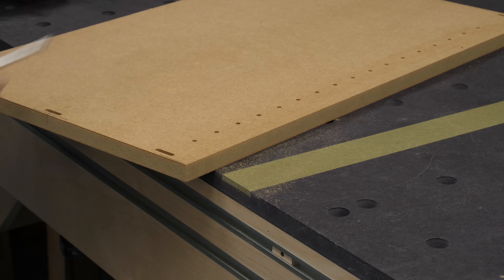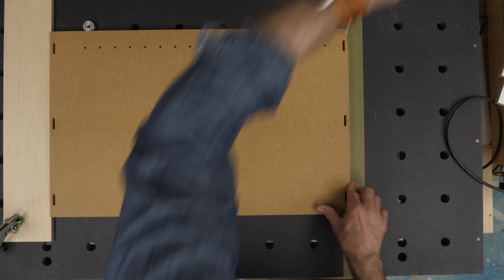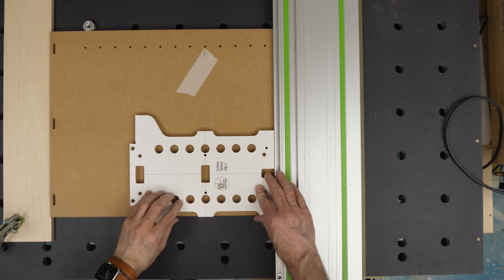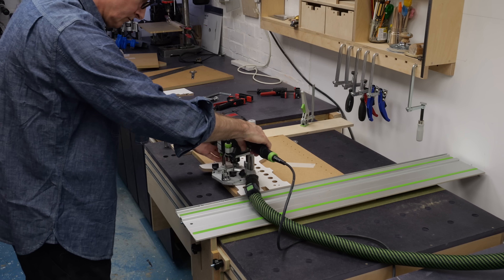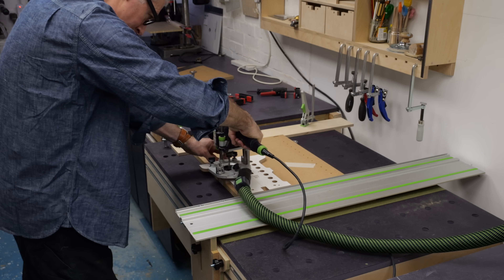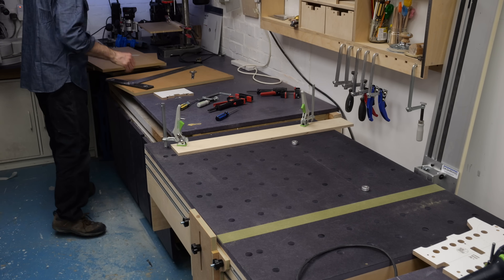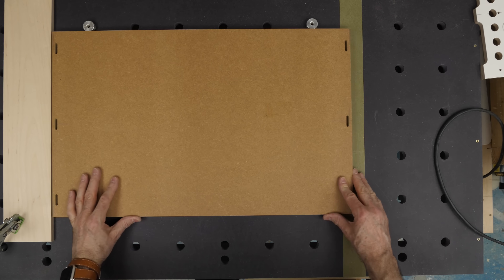A less kitchen-cabinet alternative is to use a centre hole with one either side. This is easily done by lining up the centre line against a pencil mark or an existing hole, and using the jig against a fence or batten to keep the position consistent. And yes, I really should have clamped that down. For the shelf pin holes on the other side of the cabinet, you obviously need a reference off the same edge.